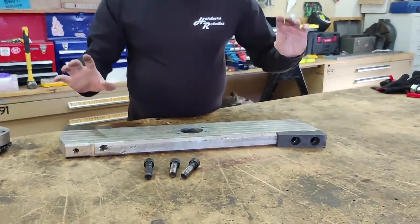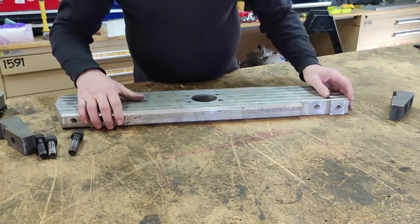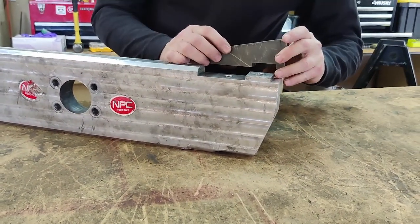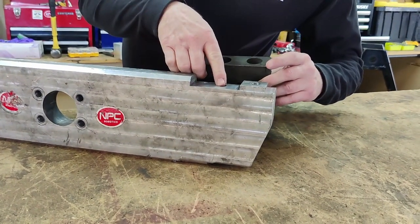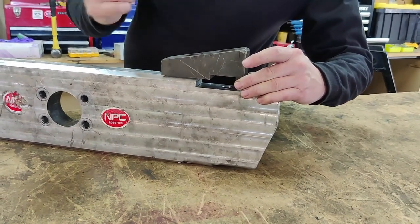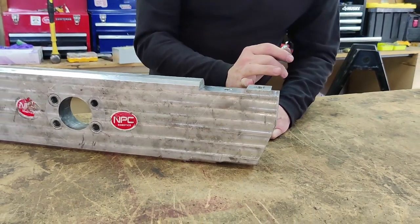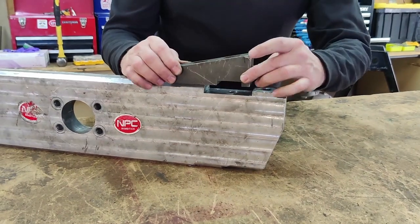So we're going to modify it. We're already taking the bolts out for the teeth, so we'll take the teeth off the bar. The mount has two large bolts and a big key arrangement to hold the tooth in place. I'm going to cut it back far enough that I can reuse this hole and just move the tooth back here, so I only have to drill and tap one new hole. But I'll have to machine it down in there to get it all to fit.